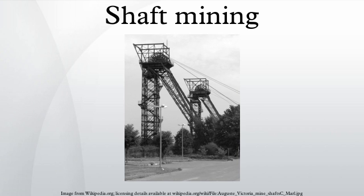If access exists at the bottom of the proposed shaft and ground conditions allow, then raise boring may be used to excavate the shaft from the bottom up; such shafts are called borehole shafts. Shaft sinking is one of the most difficult of all development methods. Restricted space, gravity, groundwater, and specialized procedures make the task quite formidable.